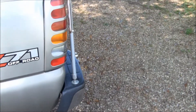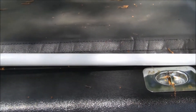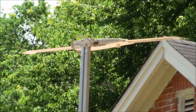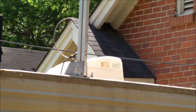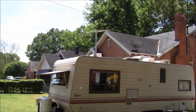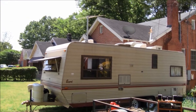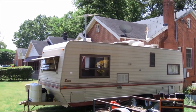Last and least — one of the more important things for most folks nowadays — this is a WiFi antenna. It is an 8 dB gain antenna. I don't have the coax for the rest of the bracket yet; it's brand new, just out of the box. I'm going to mount it up on the side of one of the struts for the TV antenna, run the coax in, and hook it up to a router to make an access point. With that antenna I'll be able to connect to any area WiFi that may be a little farther out than we can normally reach. I've also got a big parabolic dish that I can put up if I need to — it's about 35 dB gain, compared to just 8 dB on this one. The higher the dB, the more gain you get and the better you can pull in a weak signal.